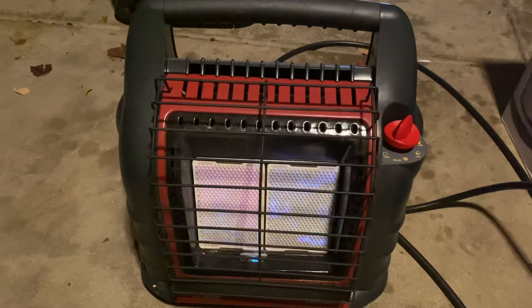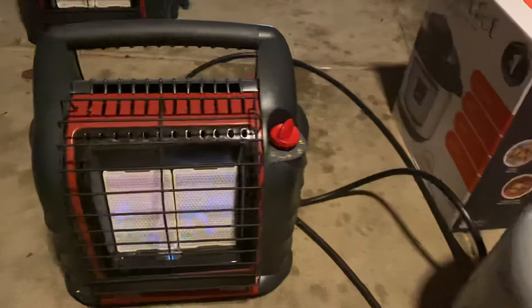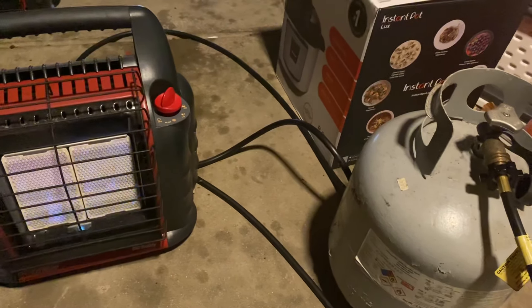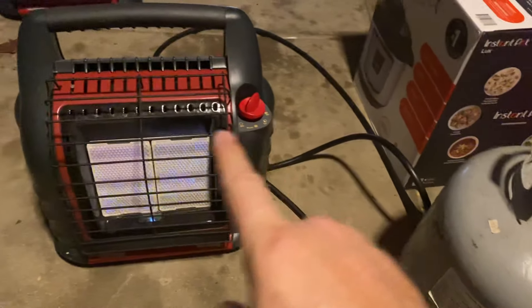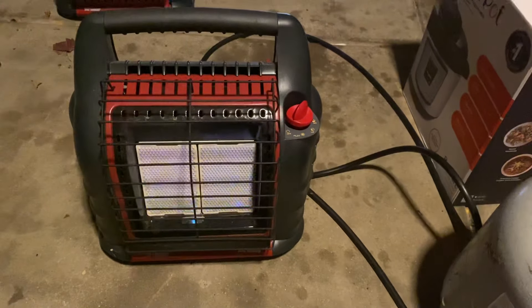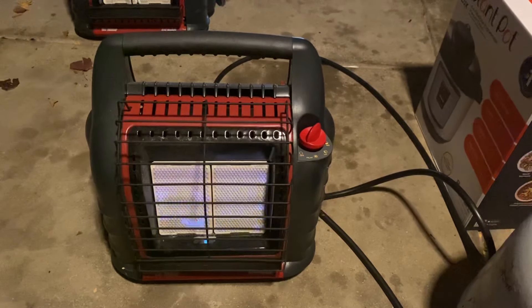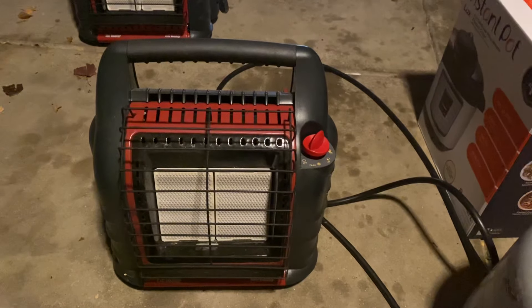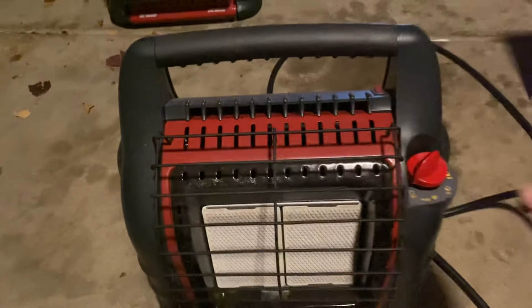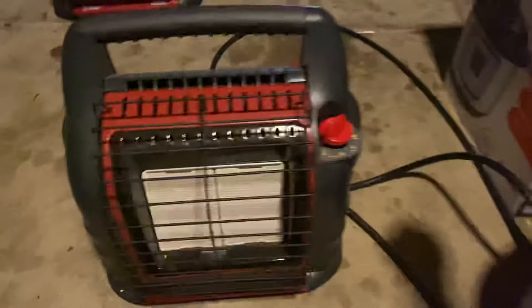It's having trouble already. This is because I turned on the propane too quickly. The reason it's doing this is because of the regulator. There's a regulator here and here — I only have the line hooked up to the right side. The regulator has a diaphragm inside, and if you flood the line too quickly, the diaphragm trips the off switch.